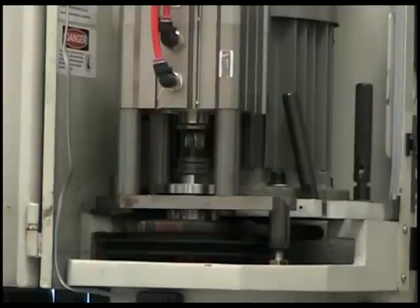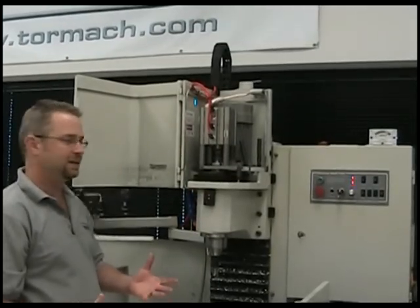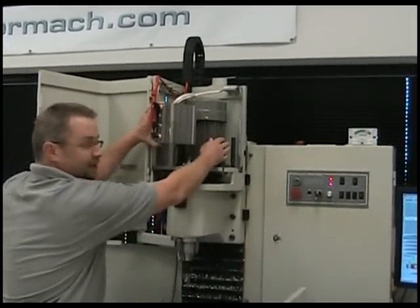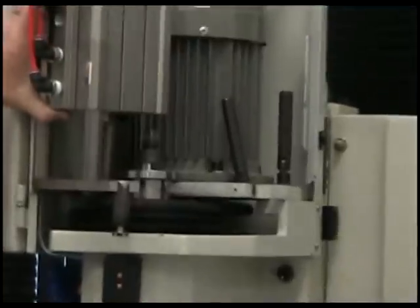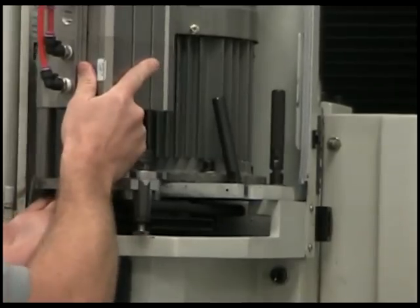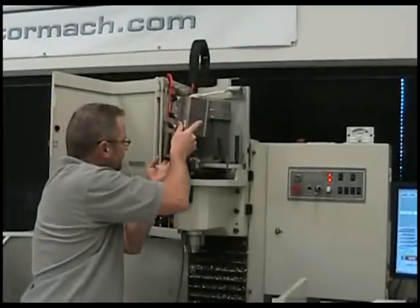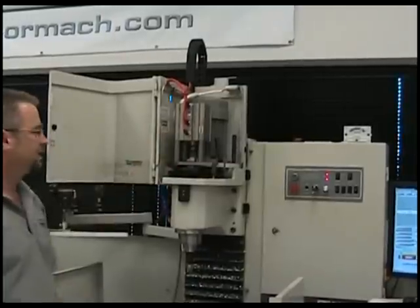The whole thing swings out of the way, right? Yeah, you have all this mechanism in here, but you still need to be able to do belt changes. That was a critical element to the design — how do you add all this mechanism in an area where you have to get your fingers into? So our system easily pivots out of the way so you can still access your tensioning mechanism and get your hands in onto the belt itself. If that's not enough, the whole unit will easily pull out and place back in. You simply pivot it back into place and away you go.